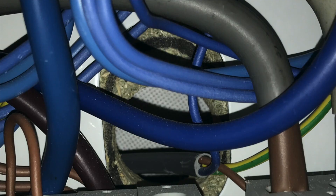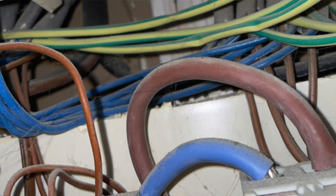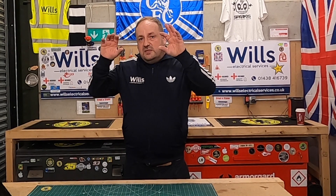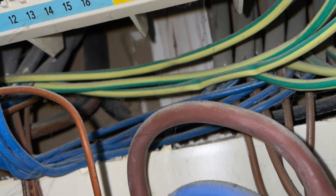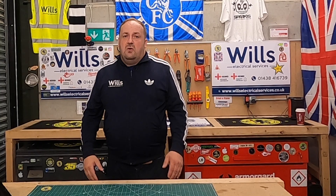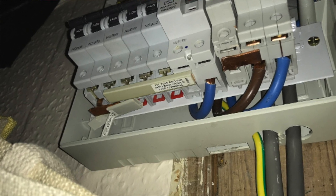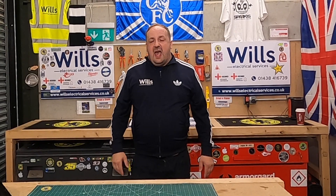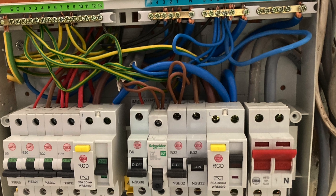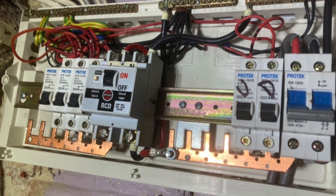Other things I look for inside the board: make sure it's been fire-proofed from the back. A lot of mass-produced flats are in partition walls and the back hasn't been fire sealed, so you've got a great hole coming through. I always take photos of that, check the busbars, and check the overload devices against the maximum cable rating per circuit.